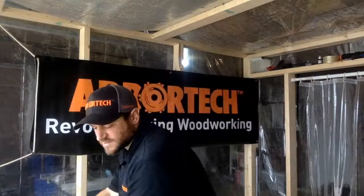So our GP blades, general purpose blades, are exactly what they sound like. General purpose, perfect just for your everyday mortar, aerated concrete. You can even go as far, if you want to, as using these to cut underground roots through sand and soil. So you've got that nice piece. It's an added feature there.